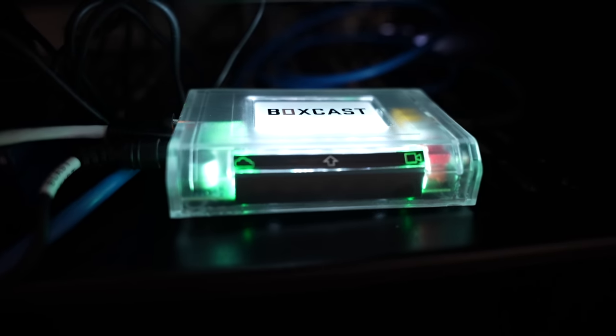On the video and broadcast side, by the first trip we were already streaming through ProPresenter, but this time we switched to Boxcast. We're taking a feed out of the ProPresenter computer into Boxcast and streaming from there — volunteers don't need to worry about starting and stopping the live stream, it happens automatically. Previously all projectors and TVs were receiving a signal over HD BaseT — HDMI out of a computer, through a converter to network, then network back to HDMI — a lot of conversions, and it was also using Apple's native display output, which can be unreliable. We installed the Decklink Duo and made sure all cable runs were done properly, so now all projectors and TVs receive an SDI signal.